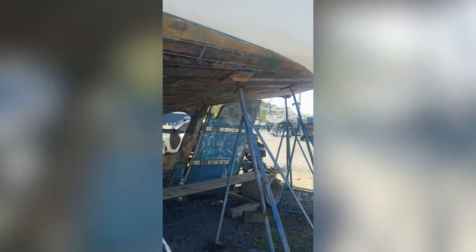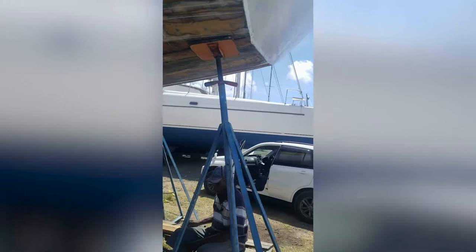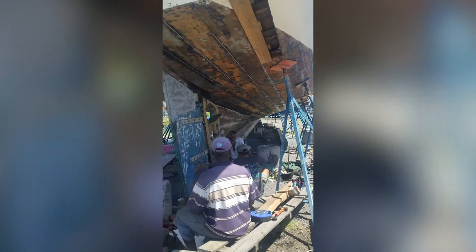There was another piece that fell just a little bit short of perfect, so the guys took care of that. Here at the transom we found a small soft spot, and when we explored it a little bit it was a little bit bigger — so the gentlemen have taken it out. Sometimes one small spot you want to take it right to the end. We're having a break here and we'll be moving on to paint the above-waterline, and later on we'll continue with some sanding.